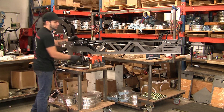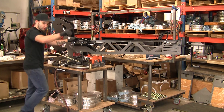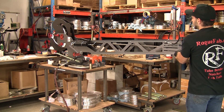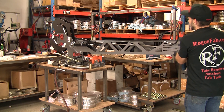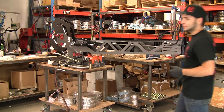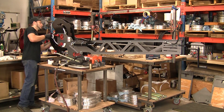Now we're going to release pressure from the drag system and then we're going to pull the mandrel out the back using the Acme Drive crank. And this has a generous amount of travel for extraction. You can kind of determine how much you need — it's related to spring back and what material you're bending — but I only used about three inches of travel there.